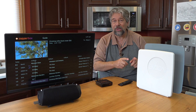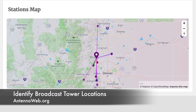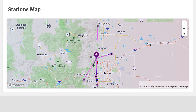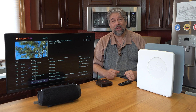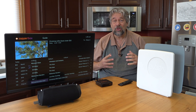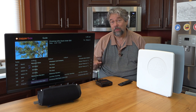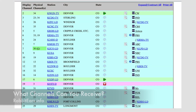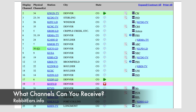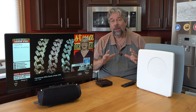I'm currently pointing in exactly the wrong direction. A website called antennaweb.org lets you enter your address and shows you where all the broadcast antennas are, giving you the information you need to figure out what direction to point your antenna. In my case, the signals are primarily coming from the south. Another great resource is rabbitears.info, which shows all the channels you should be able to get over the air and what your channel lineup should be. This antenna is really easy to work with.